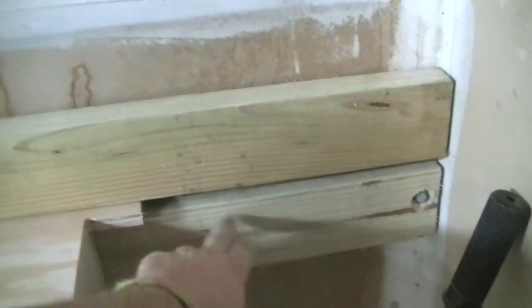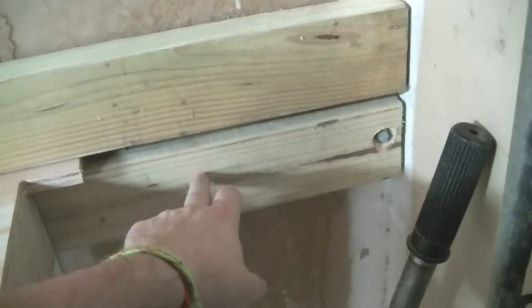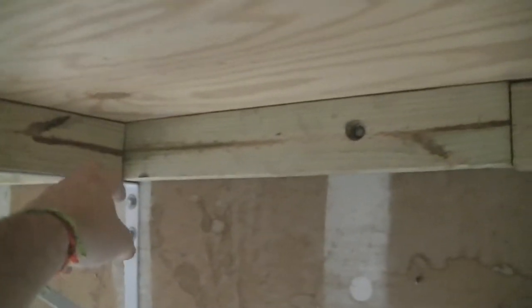Cut this off. The only thing is, with this board right here that we see - this is the entire 12-foot 2x4. But this board was a piece of a 12-foot, 10-foot board that comes in. It's lag bolted into the 2x4 right here and at the other end, but there's nothing connecting it here. So what I'll end up doing, once I cut it off from here, is stick it back in place and then cut a new board the same length and just attach it to this guy. And if I had a long enough lag bolt, I'd go straight through the new board, through this one, into the wall. But at least, by putting a board back here, I could stiffen this up a bit, because this is the weakest point for it.